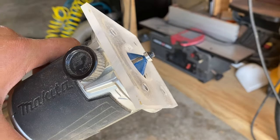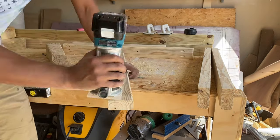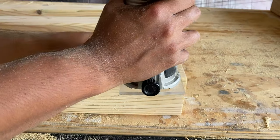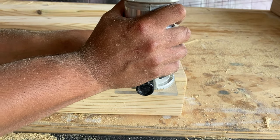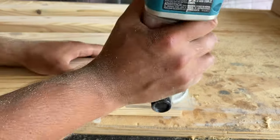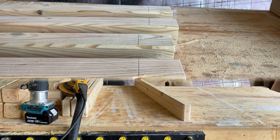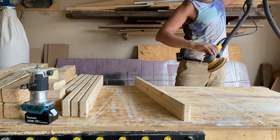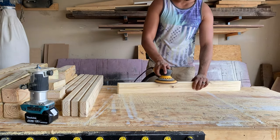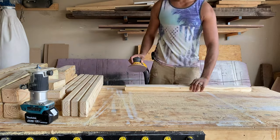If you've seen any of my other videos, you know I'm a huge sucker for a good chamfer profile. Since I was going through all this extra effort for tapered legs and clean edges, I figured I might as well go the extra mile for a good profile edge too. So I put my chamfer bit in my trim router and went across every edge I could find, including the inside corner of the tapered table legs. That gave me a nice flat surface to sink our threaded inserts into, since we want to make sure these legs can be removed. Before assembly, I went ahead and sanded everything, because it's way easier to sand individual components than to sand awkward angles underneath the table.